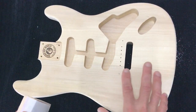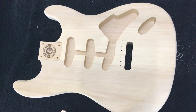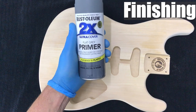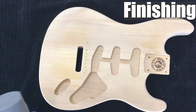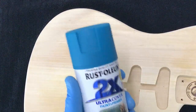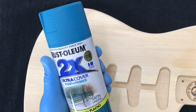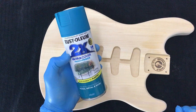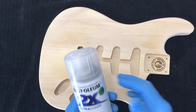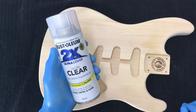Once the top's done I'll start working my way around the edges as well just in case there's any marks. In this case I'm using Rust-Oleum 2X flat grey primer. I'll probably do two to three coats of this primer, followed up with at least two to three coats of this Satin Lagoon Rust-Oleum, which is a paint and primer, and we'll finish that off with a clear gloss which is also Rust-Oleum 2X.